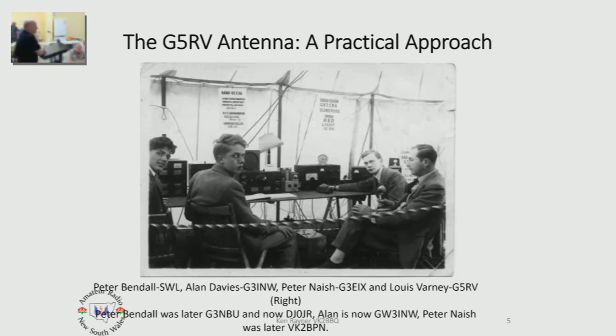It's a very easy, light antenna. As you can see from the antenna that's coming around now, it's not something which is particularly heavy. It's not hard to string her up in a tree and to run. It's centre fed, and being centre fed, that means that the radiation is essentially coming out of the centre, and the critical height on these antennas is in the centre, where the centre feed is, because that's where most of the radiating occurs.